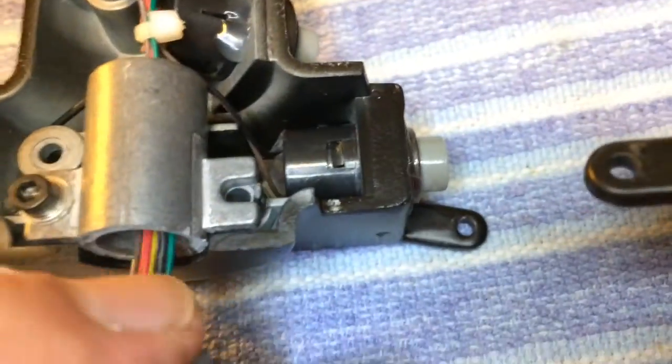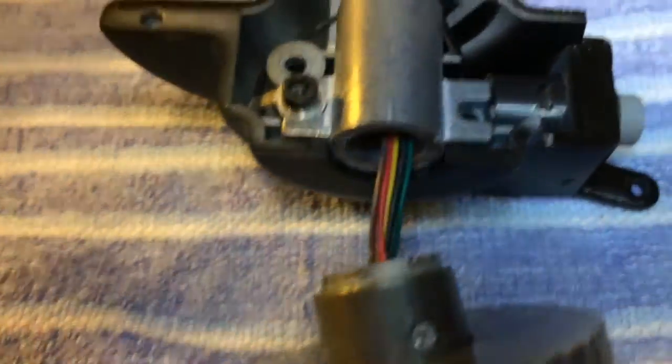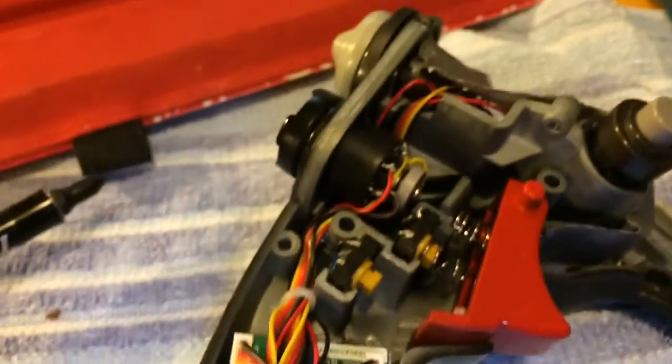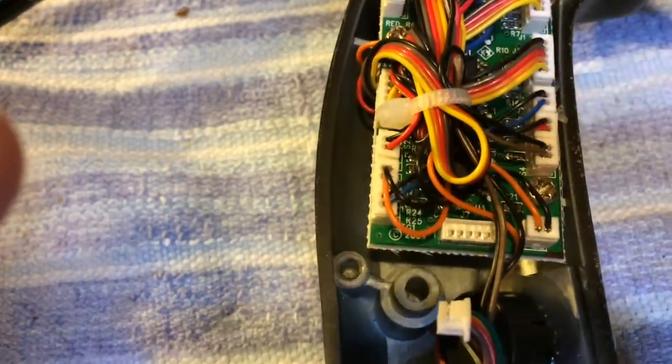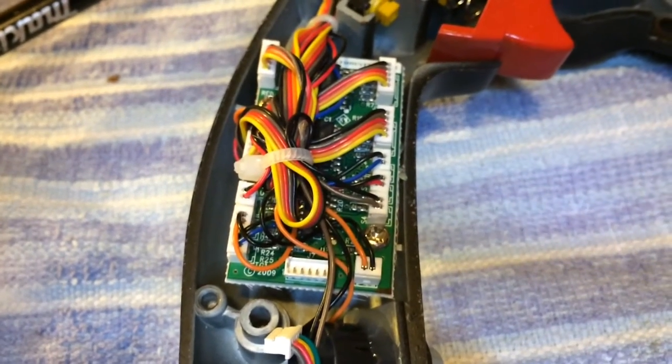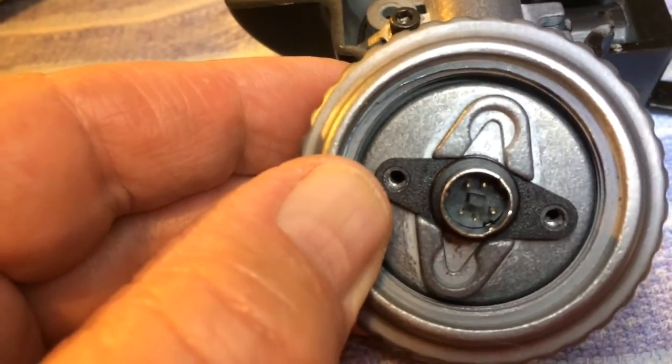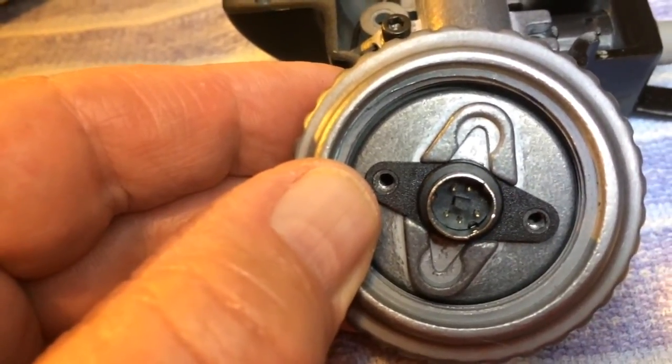So we have to find a corresponding clip. If they were smart, it's going to be one of these connectors, because the board is pretty well laid out. The rest of them are just simply switches. The board interprets those switches and then feeds the signal through probably some sort of USB protocol — out through this 1, 2, 3, 4, 5-pin plug. Looks like a DIN plug.